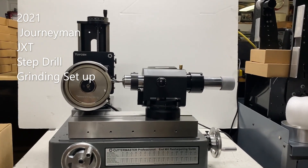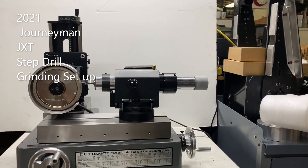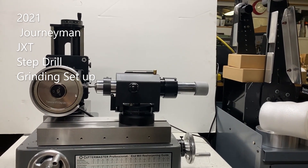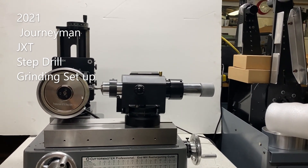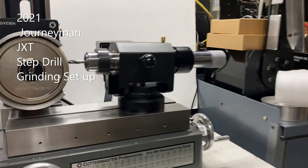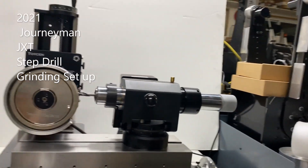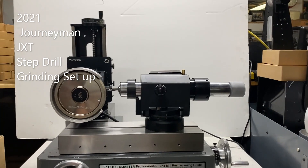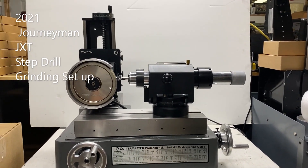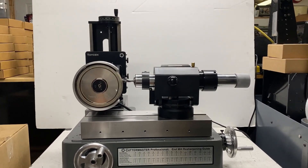It has our new air spindle on it. This new air spindle this year is milled from solid. It's got a very nice fit. There's about 5 tenths total clearance in the bushing. The bushing is brass and it's replaceable — it presses out the back. There's a 1 thou step in it, so you don't need to buy the whole spindle like you used to with the Cuttermaster. The tubes are replaceable and we've made them all the same size.